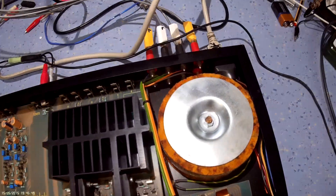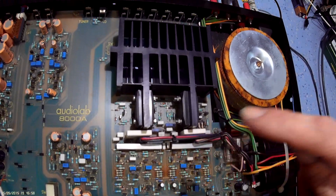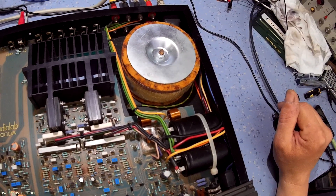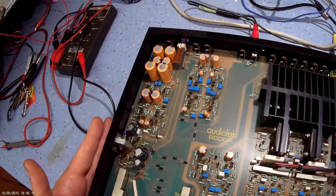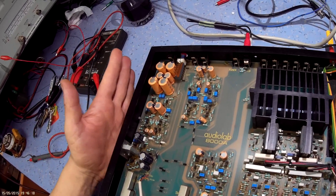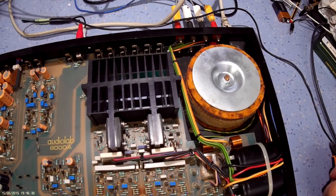I'm going to have a quick look. You can see there's been some damage here before — this is fairly common with these amplifiers. You can see this discolouration. These resistors they use are working at their limit all the time — probably quarter watt resistors with quarter watts going through them all the time. Obviously to save money, but it does mean they run hot all the time. I've also noticed this regulator here, which I think regulates the supply for the phono stage. That is actually very hot as well, so I might need to look into that.